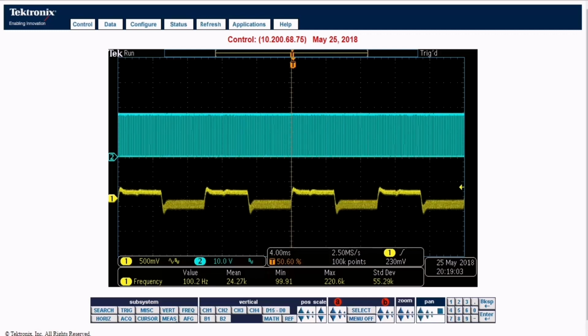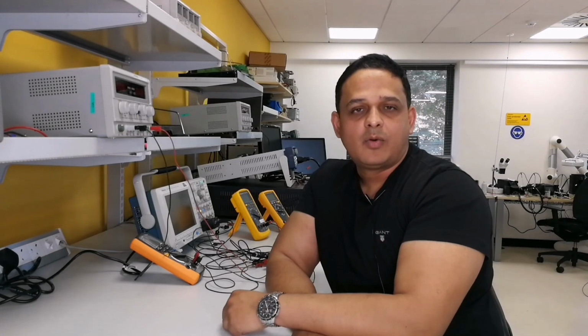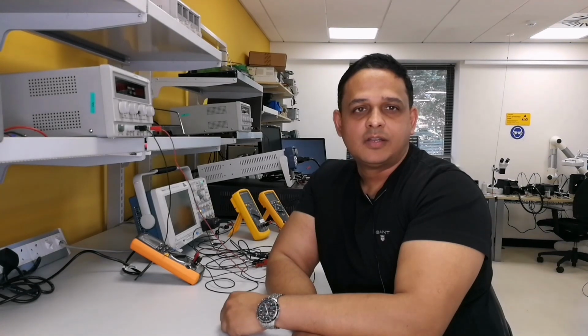where voltage is being regulated by regulating the voltage at the primary side capacitor. Isobuck can provide plus minus 10% output voltage regulation and it is ideal for high efficiency, space constrained applications where usually a post regulator is used to further regulate the output voltage. The main advantage of isobuck is that it has simple control with one magnetic element and it can provide multiple output voltages with and without isolation.